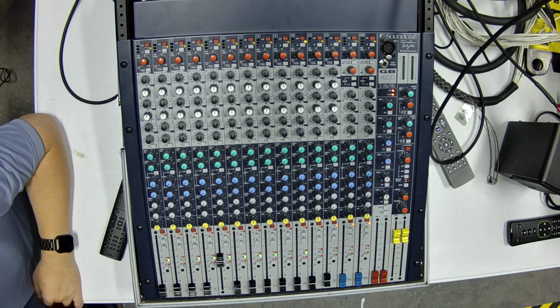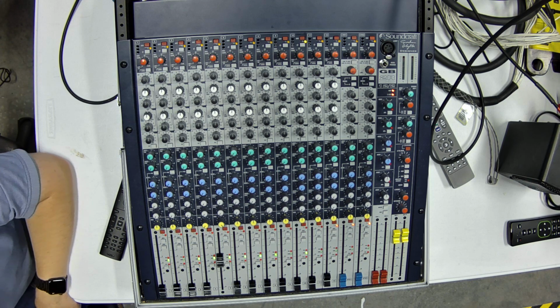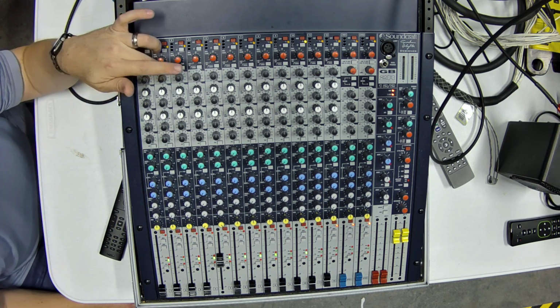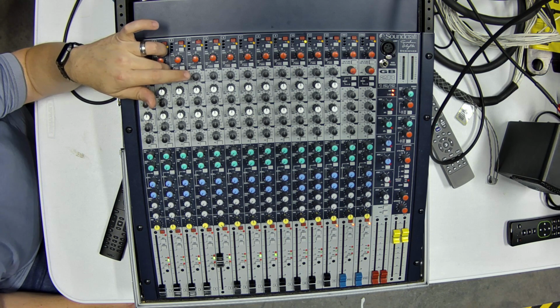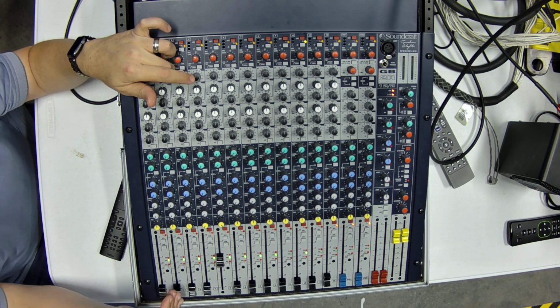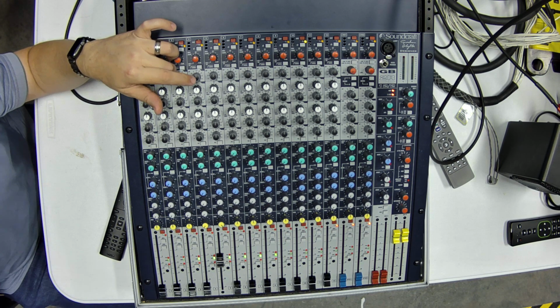So a way to combat that is to filter, and this is kind of what Sam was getting to. You were getting close in principle to this. Even though the signal from the mic itself doesn't have low frequency energy, you can turn on that filter so that it's not picking up the low frequency energy from other signals that are nearby.